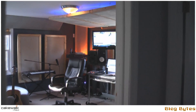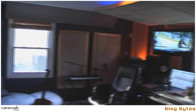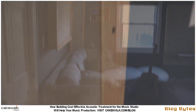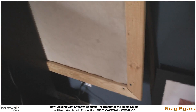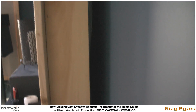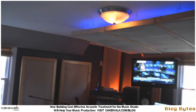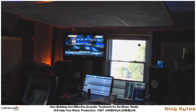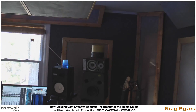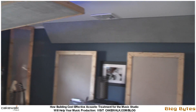This is what the studio looks like now with all the panels up on the walls. There's the sound cloud over the mix position, and all the corners are knocked out in the room. There's that inch-and-a-half air gap that allows the frequencies to go in between the wall and the back side of the panels. The room to begin with is really not a great mixing environment — it's a square room, which is pretty much worst-case scenario for mixing.